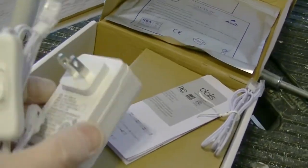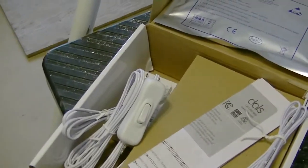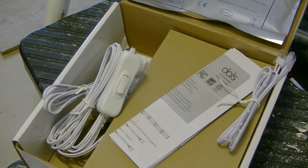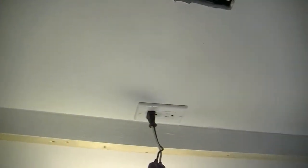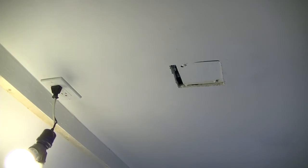The whole reason for this is because with these LED strips, the power supply is a plug-in adapter, and it's got to go somewhere. There's another option — to use a driver, which is basically a power supply in a nice little metal box — but they were going to charge a ridiculous sum for that, so rather than spend more on the driver than for the lights, I went with the default option and installed that wood. Some of the light from the LED strips will reflect off the wood, so it was necessary to prime it, and later on I'll paint it white. The junction box has to remain accessible according to the electrical code, so I'm going to make an access panel so it will still be possible to get to it, but hopefully it won't look too ugly.